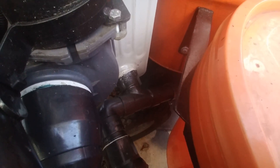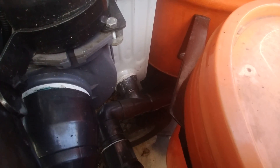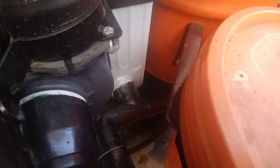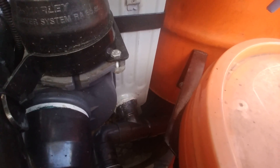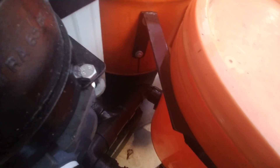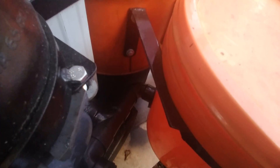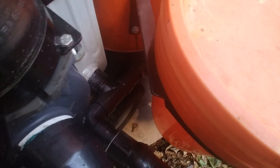On either side of a T-piece there's a tap so that I can control the flow. The taps aren't placed directly on the T-piece — by moving them to other positions it still has the same effect directing flow one way or the other, but it provides two bonus functions. The first is that any condensation that builds up inside the radiator trickles down to the lowest point, which happens to be down at the entrance to the main filter. That means the main filter can also act as a second condensation reservoir, and that gets drained with a drain bung.